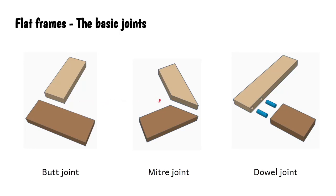A slight improvement on that is the miter joint. The miter joint is cut at 45 degrees for two reasons. One, it's a prettier joint - more beautiful to look at. And also it slightly increases the gluing area. The size of that rectangle in there is slightly larger than the other, so more glue equals a slightly stronger joint.